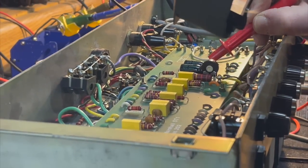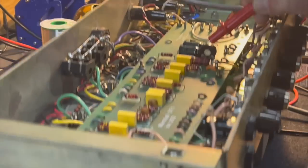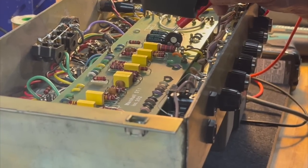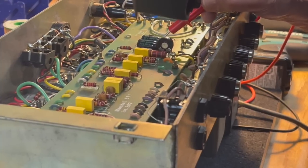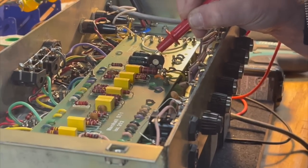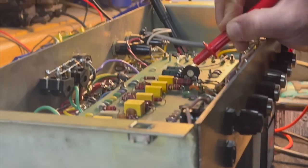And they're USA capacitors, so they have been replaced, because if they were original, they would be from a European or British supplier. Makes sense. And the date code is a little indecipherable to me. It's USA 0421H. Remember that, Bruce. That's going to tell me the date and the factory that they were made at and all of that.